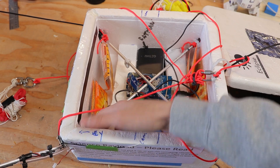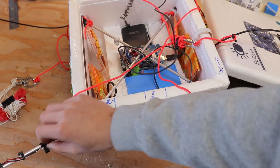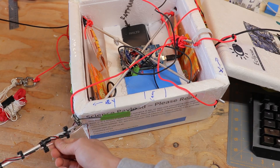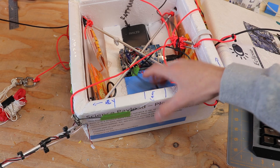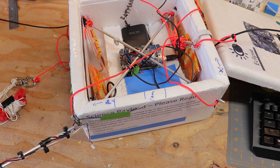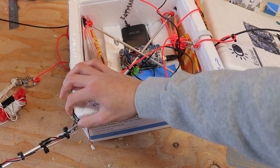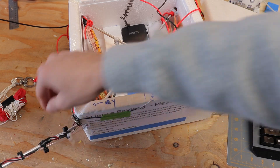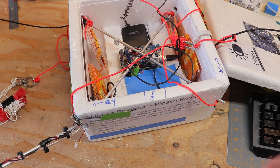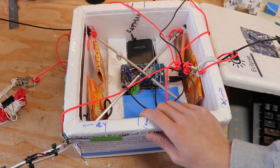Underneath the blue box there is also an altimeter wired to the Arduino — specifically an Adafruit MPRLS. There's a plastic tube that runs through the payload bay and out a corner, along a long beam, which allows the pressure to be read by the MPRLS from inside the enclosure, since there may be pressure differences. We also added a drone receiver as a backup GPS that we can plug in right at launch time.